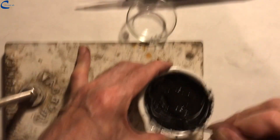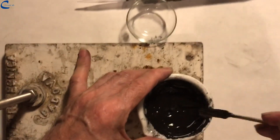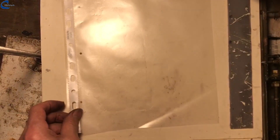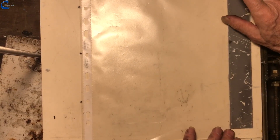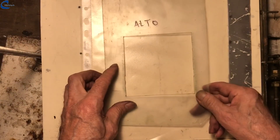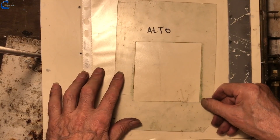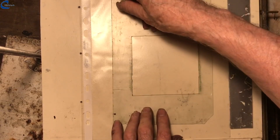Now the mixture is ready for printing. The print is made on a transparent envelope for A4 documents. The printing bed consists of a plastic PVC plate, below which there is an iron plate that allows, with the use of some neodymium magnets, to block the objects necessary for the operation to the printing bed. On top of the plastic sheet, the plastic frame is placed and firmly fixed with 4 magnets.